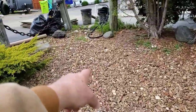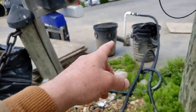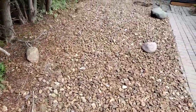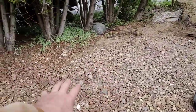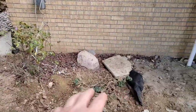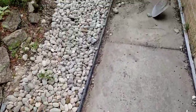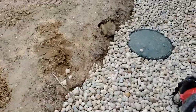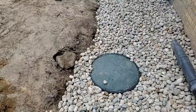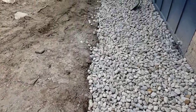These guys did a really nice job. There used to be an old sump here for all the water coming off the road — the sheet water. Here are the indoor sump systems that were put outdoors; they're now at the road for trash. We put decorative stone over our open French drain. There are landscape plans for this house, so a landscape company is coming behind us. We have our open French drain and roof runoff system in here. We ran a D-Box just for the roof runoff to catch all the shingle gravel, leaves, and debris in a 20-inch round, and the water comes out the other side into our system.